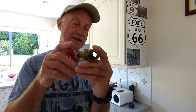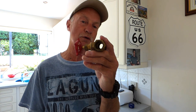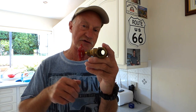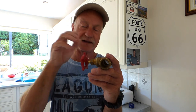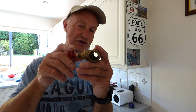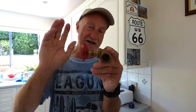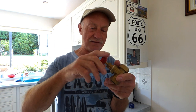If that does happen, the answer is to drain the tank in the loft via a hose - stick it in the tank over the top and drain it out into the bathroom or outside, siphon it out, drain the roof tank right down that way. Then you can undo the top of this valve and renew it. There'll be just a little drop of water in the pipe from there to the tank - not much - and you should be able to deal with that to change it.